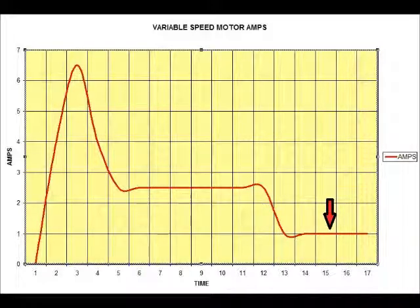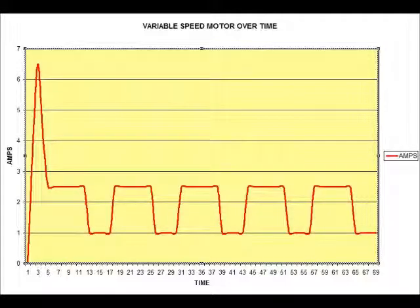But here's where the big difference is. Note at the end of the run that the motor does not come to a complete stop. It's not turning very fast and it's consuming very little amperage, but the big thing is it does not come to a complete stop. So as we look at this motor operate over time, note that there is one peak the first time it starts, but after that there are no further peaks. Why is that? We no longer have to overcome inertia because the motor is already spinning — not real fast, but it is moving. So we don't have to overcome inertia and we only come up to the running load amps, drop back down, and back to the running load amps. No more peaks.